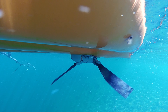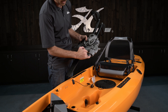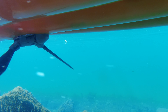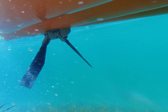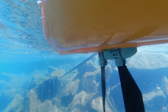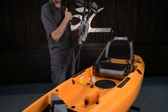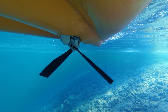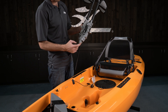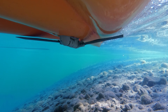There are some adjustments for the kick-up. This little black Phillips head screw — if you kick the fin up there's a little recess notch, and if you tighten this screw, it'll make it harder for the fins to break away but also a little harder to lock back into normal position. They'll be nice and stiff when you get the boat and may loosen up over time. It's personal preference — I like them pretty loose so even seaweed or kelp can break them away. Some people like them locked in and not breaking away easily. When making adjustments to the screw, make sure the fin is broken back with no resistance, make your adjustments, then test it. Don't screw it in tighter with the fin locked in the down position.